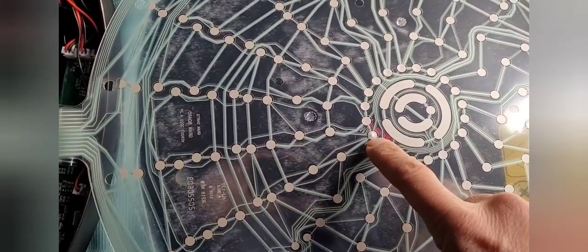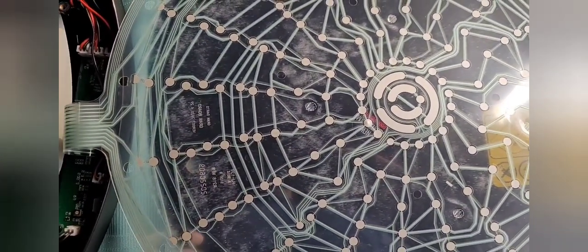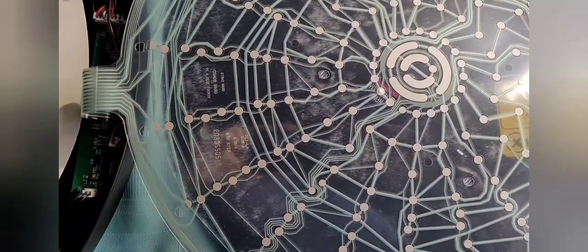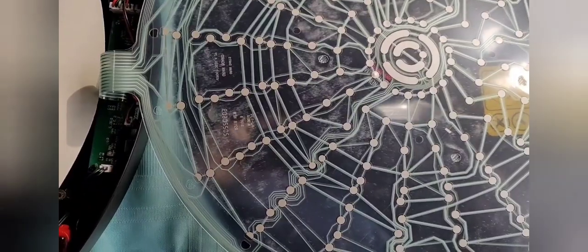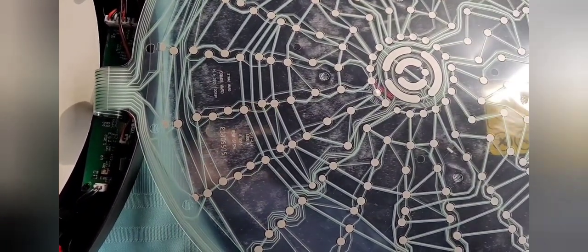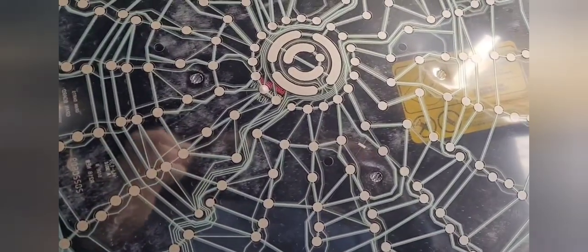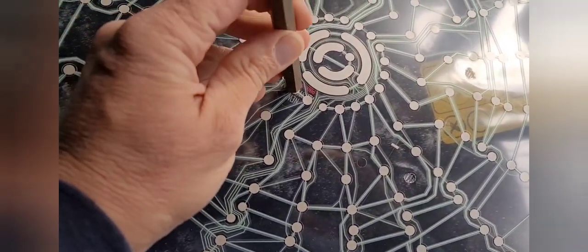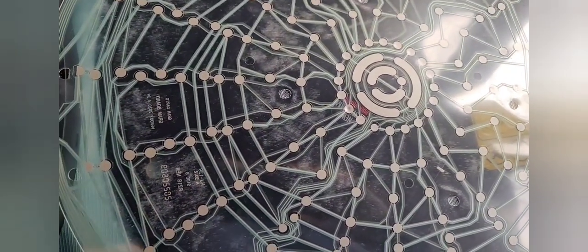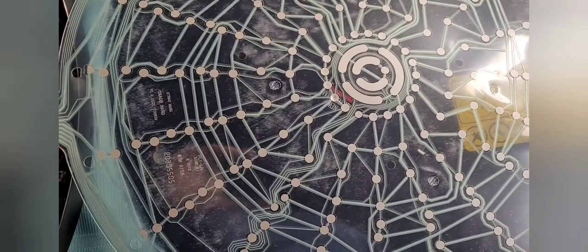Here is my dimpled segment. I have put a bottle cap underneath it. What I'm going to do is take this flat punch, use a hair dryer to heat up the segment, and while heating it up I'll take this flat punch and try to flatten out this dimple. We'll see how that works — check it and put it back together.